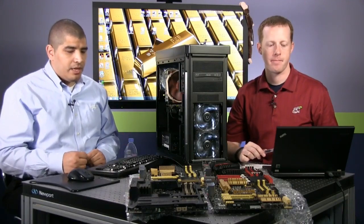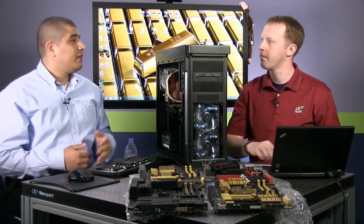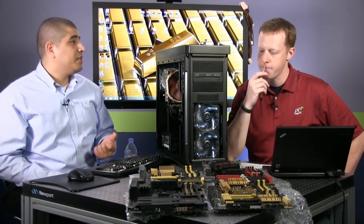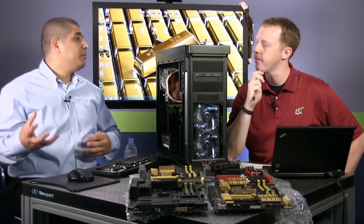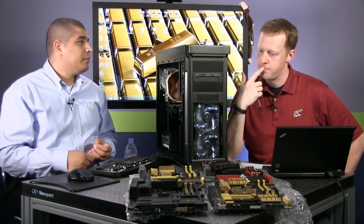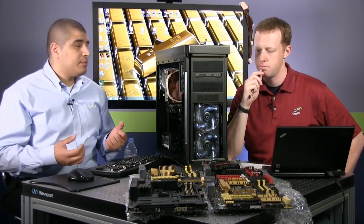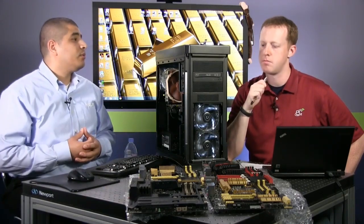Yeah. Another one might be something like our USB 3 Boost technology. In the past, we've talked about how the USB bus itself uses preset protocols for transmission speeds. There's BOT protocols, there's SCSI protocols, and there's optimally UASP protocols. So we have a hardware and software implementation that allows us to optimize the actual protocol performance for flash and for different types of external storage devices, where we can improve the performance. That's going to be on every single one of these boards.